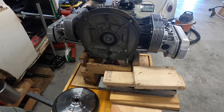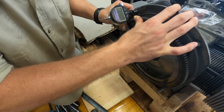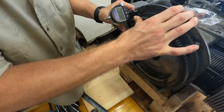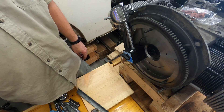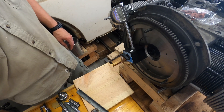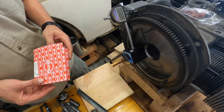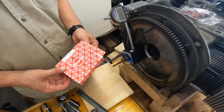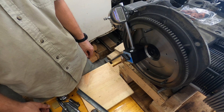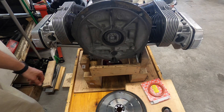Once I get everything hooked up I'll turn the camera back on. If I want to be correct with this, I need to add two thousandths to make sure I'm within limitations because it's right at 6.65. I've got to take it back off anyway because we need to put the o-ring in there, so I'll get a combination to add two thousandths and put it back on and check it again. I'll probably end up putting the seal on there, but that's risky — if it's not right I'd have to take the seal back out, and I don't have another one.